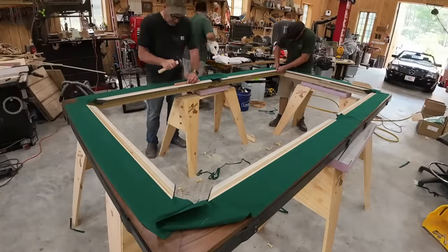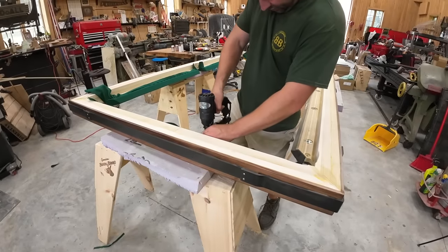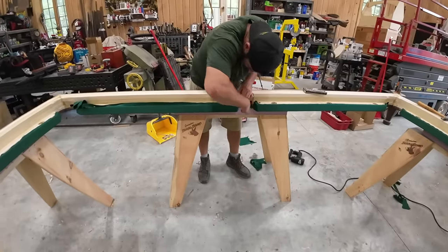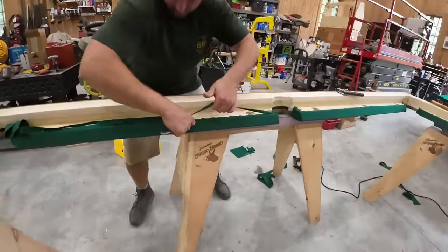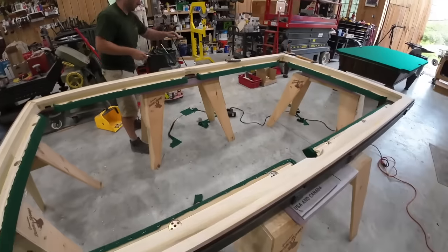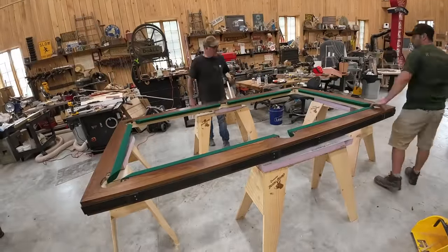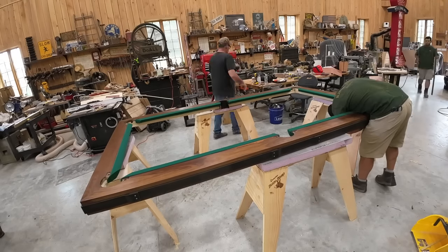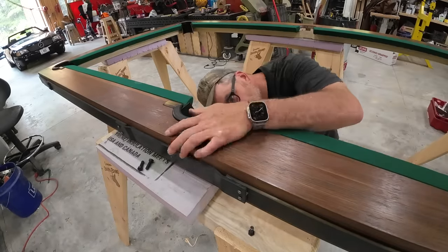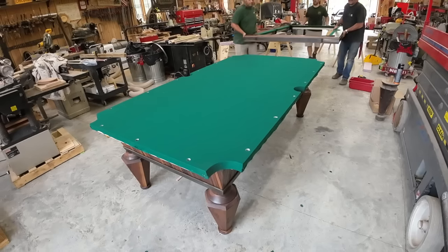We did have to adjust them with the hand plane, but we got everything in. We turned the table over and Jeff started to stretch. You could see where those little discs are screwed to the undersides of the rails — when the table was snugly fit on top of the slates, I just reached up and traced a hole through the slates with a pencil, and I knew exactly where to drill those holes and install those plates. Now it's time to install the pockets — just inspecting, making sure everything looks good. Jeff wants to make extra sure he didn't trap a staple or a piece of sawdust between the felt and the rubber. Each one of the pockets gets bolted up from the bottom.